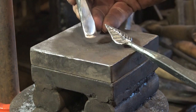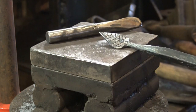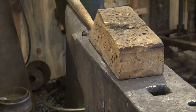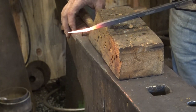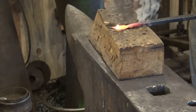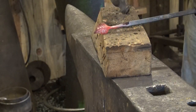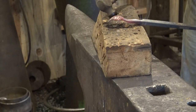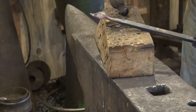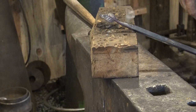So there's our chiseled leaf, and there's our little chisel — this one's made from S7. We're going to get that hot and do a little bit more shaping to it. This is still kind of flat and lifeless even though it is clearly a leaf at this point; we can make it look better. This is a wooden block that I use under the drill press that just happened to have a nice hole in it. You can use the end of a stump or something else with a nice depression, but you don't want to mess up your veining in an iron tool. Work this around so you don't create kinks — what I'm doing is giving it a nice dome shape. But I don't want the leaf to just be a little bowl; I want to bring that tip forward. This is all just artistic — whatever you want your leaf to look like. Doing a little bit to give it some three-dimensional shape really makes a difference.